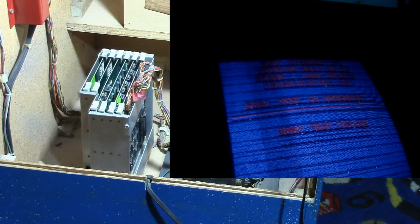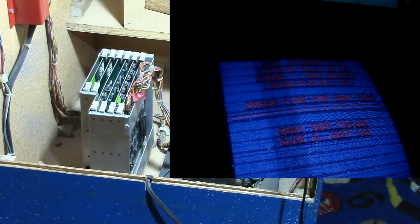All right, it says again, chip at U10. Wait a minute, was that other one? No, it said slot 6, I believe. U10. All right. Try it a few more times. If it keeps going back to U10, then we'll change U10. Like I said, this test could be a little flaky, or maybe it's just my particular game. Okay, U10. So let's go ahead and change U10.